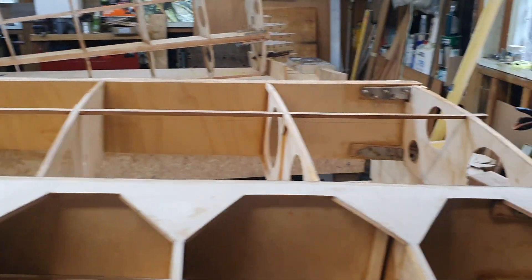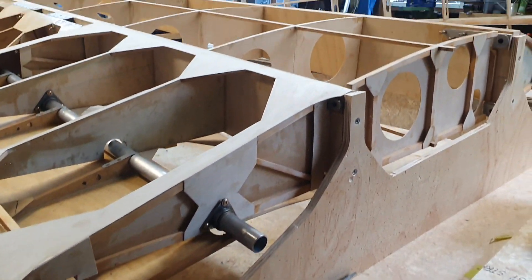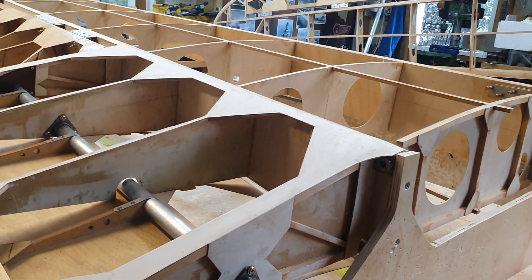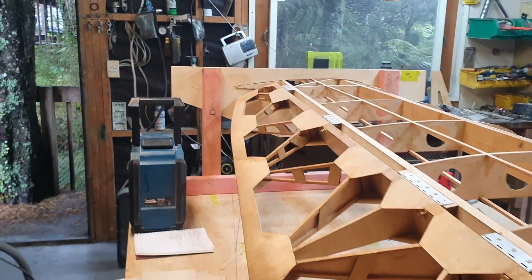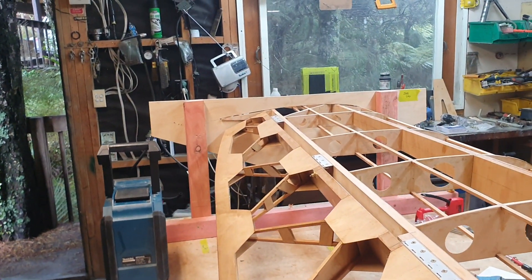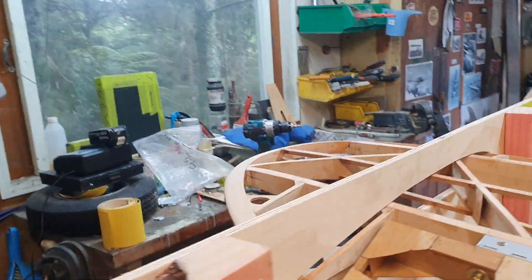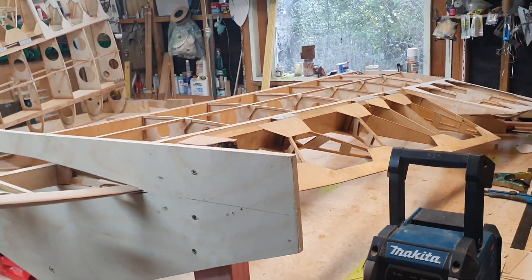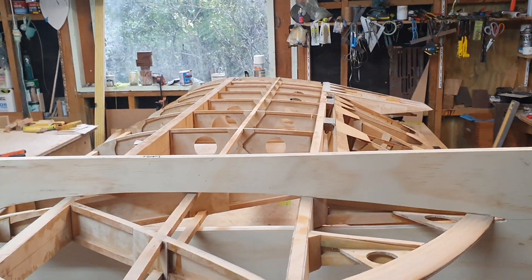Take a look at that. We've replicated the flying position with a little bit of ply. As long as I check the table regularly with the laser, it is in its correct position. I just carried the other bracket I made from the original setup in the hangar, and we just level the top and that gives us our washout. It's quite noticeable actually.